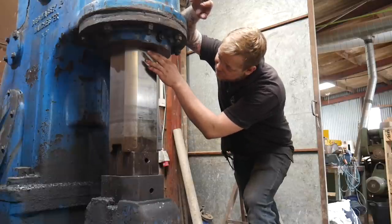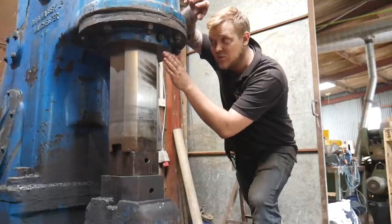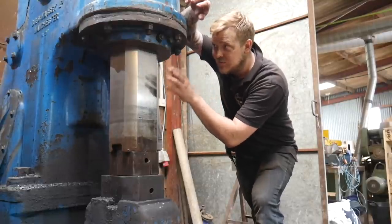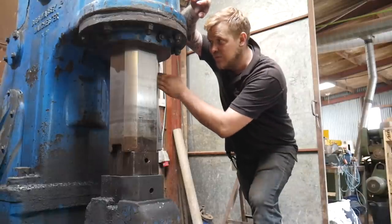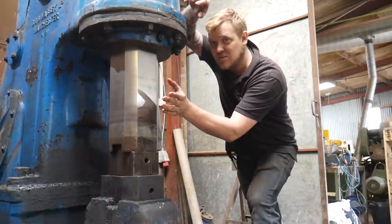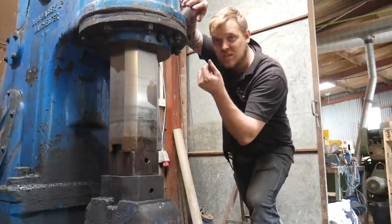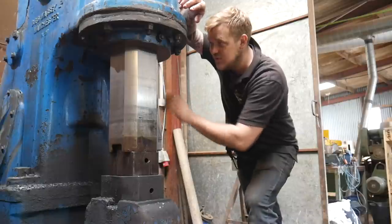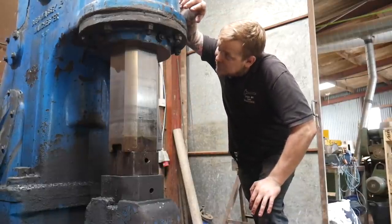he did say that the last time we used some jointing paste to seal this up. I don't necessarily think that that's worked very well this time. So what we've done, just measured it up all the way around. We're going to put jointing paste in again. I'll show you what that is later. But we're also going to shim these with some actual pieces of metal. Put the shims in, and then hopefully that's going to make everything nice and tight again. And some more work.